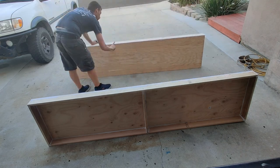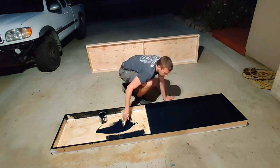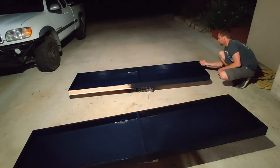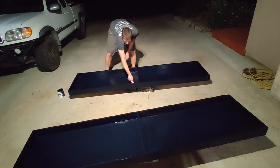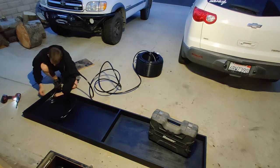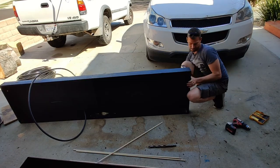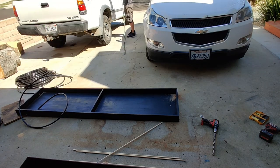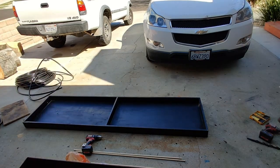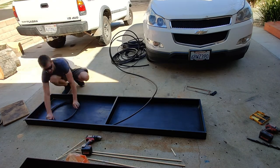And I wouldn't have had to carry these massive panels up onto the roof. It's just not worth it. I love all these channels out there that are touting this as the end-all, be-all greatest thing since sliced bread way to build these panels. But the reality is they cost a significant amount of money to build, and you're using material that wasn't meant to be used this way. Mine already need to be repainted — I used exterior oil-based paint and it's already flaking off. I'll be honestly surprised if these survive another summer on my roof without melting something. There are pictures at the end of fittings that are just distorted and bloated from sitting in the sun. I think at one point I recorded water temperatures pushing 130 degrees — that's insane to be running through poly tubing that's meant for irrigating your garden. So that's my rant. If you'd like to continue watching, feel free. Thanks, and as always, we'll see what I got next.